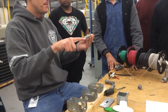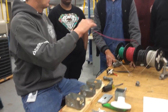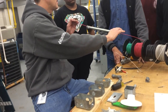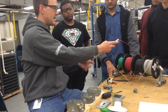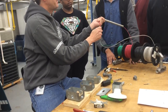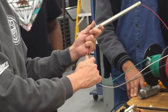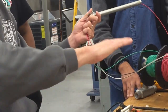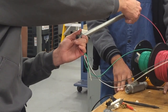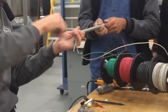If you had a really long run of pipe, you'd need to fish wire through it — push a solid wire called fish tape through one way if you're pulling more than one conductor through the conduit. You make a hook, attach all your wires, wrap them, and tape up both ends with electrical tape. One person feeds the wire in on one end so it doesn't get chewed up around the connectors, and another person on the back end pulls it through. That's fishing the wire — that's how they get wire through long runs or short runs with bends.